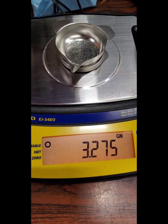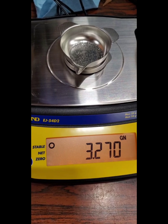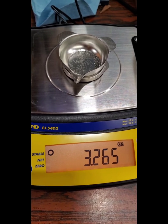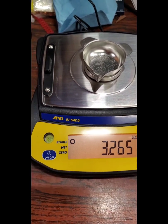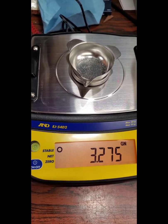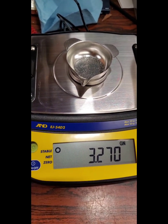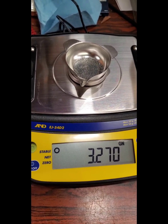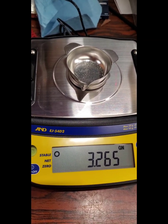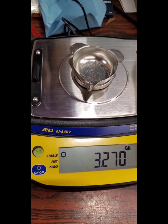And it shows that the Mark 7 powder measure is super accurate. I held it with the previous scale to 0.02 of a grain accuracy, and what I've been observing with this so far is with powder that's properly settled in the powder measure, it seems to be accurate to 0.01 of a grain repeatability. So max spread, like it only ever seems to maybe throw a little bit low. It doesn't ever throw high. Whatever you get the charge weighed into, it's bang on that, and it might go a little bit low every now and then. But by a little bit low, I'm talking 0.01 of a grain with tight group powder.